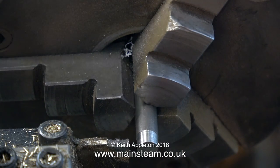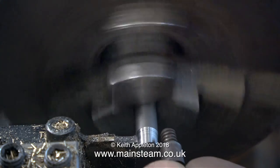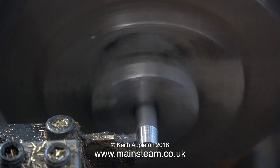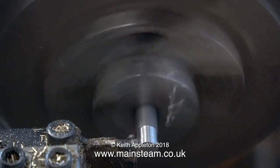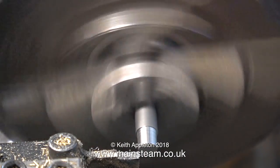In this clip I'm comparing the length of the original crank pin, because I need this to be exactly the same. I'm taking a fraction more off because I need to round the end — not strictly necessary, but it's good practice. This is the end that's going to take the nut and washer that will hold the connecting rod in place. I'm also going to have to make a crosshead, a piston rod, a piston, and I almost forgot a cylinder cover too.